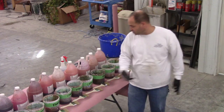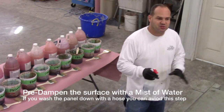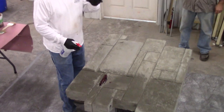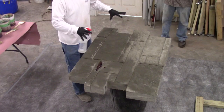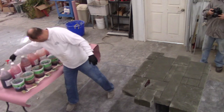I'll illustrate by taking a teal. Actually, before I do any work, I want to spray it down with a little bit of water — here's why. If we have a dry concrete piece, when these things come out of their molds, there's a little bit of mold release, a little bit of form release. It's not going to affect our stain or our seal, but it might create a little bit of surface tension which will not allow your stain to penetrate evenly.